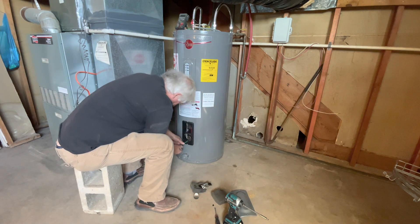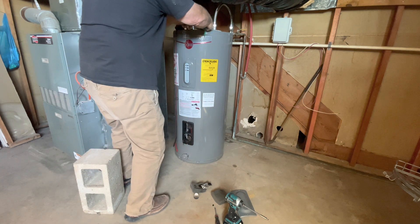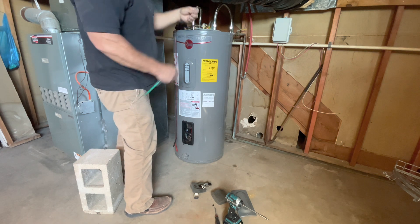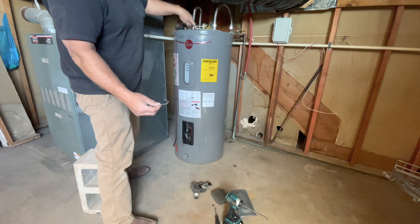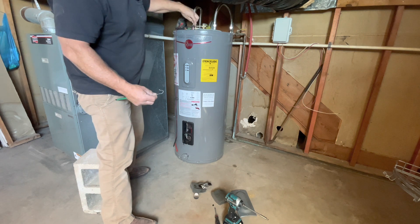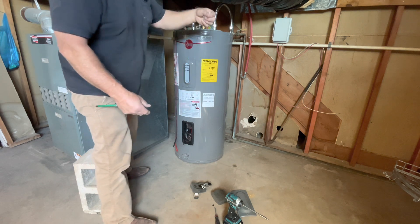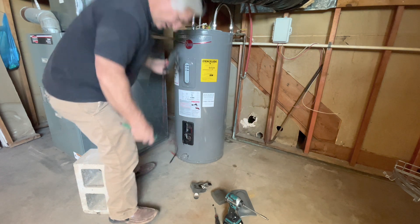What I'm going to do is take this red line — I'll disconnect these even though I know I have them off, just to be sure. I should have brought my sniffer down — that just checks for power. This is the casing on this BX cable. You're supposed to have a little red sleeve in here that almost looks like a wire nut cut off at the end, sleeving inside to prevent cutting or penetrating of the wire from this sharp edge. I mean, this is razor sharp. Dirty hands — this is the epitome of dirty hands.